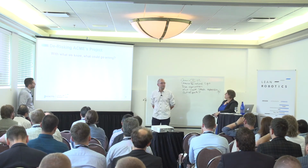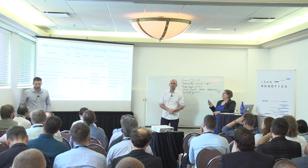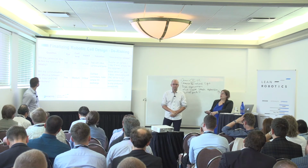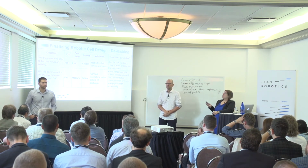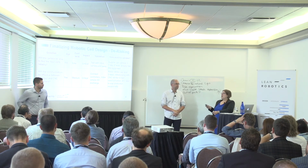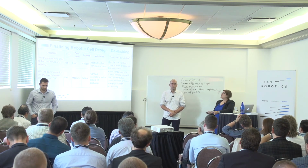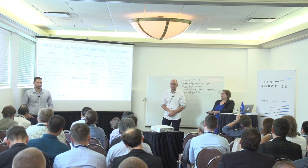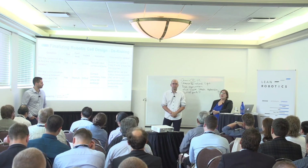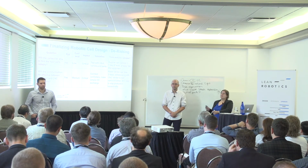So the idea here is to look at those and go through what's a pretty standard risk analysis. How important is this to my project? How much trouble am I going to be in if that doesn't work? And can I fix it? As we go through the de-risking process, we're able to see whether I need to eliminate the camera from Louis' design and go with a different type of part presentation if I can't find a way to have reliable lighting. Am I sure that the CNC machine can support IOs? Maybe it's an old CNC machine. So how do we focus and have a plan for going around it?